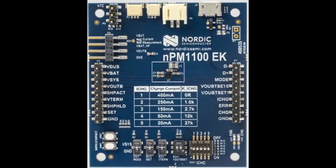Yes, this chip is designed to be used with Nordic chips — they're promoting it for use with the NRF91, NRF53, and NRF52 series. However, this chip is not just for Nordic chipsets. You could use it with any chipset; it's wireless-agnostic. They're branching out into a new product area, and it's meant as a sister product to their existing lines. But you shouldn't think you can only use this with Nordic — you can use it with any project that needs adjustable voltage output.